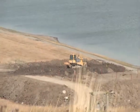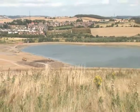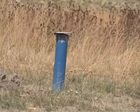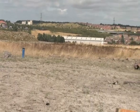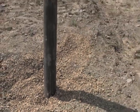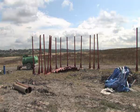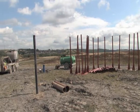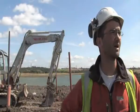There are three large load test areas. There's the one here by the reservoir where the water table is relatively high and close to the ground surface. There are another two locations to the north end of the site — one situated over the deepest part of the backfill and one approximately partway in between. The upper large load test areas have access tubes or bore holes drilled through to five metres below ground level, and they'll be inundated with water once the initial compression has been achieved, to induce a little more settlement and observe the effect of the rising groundwater table.